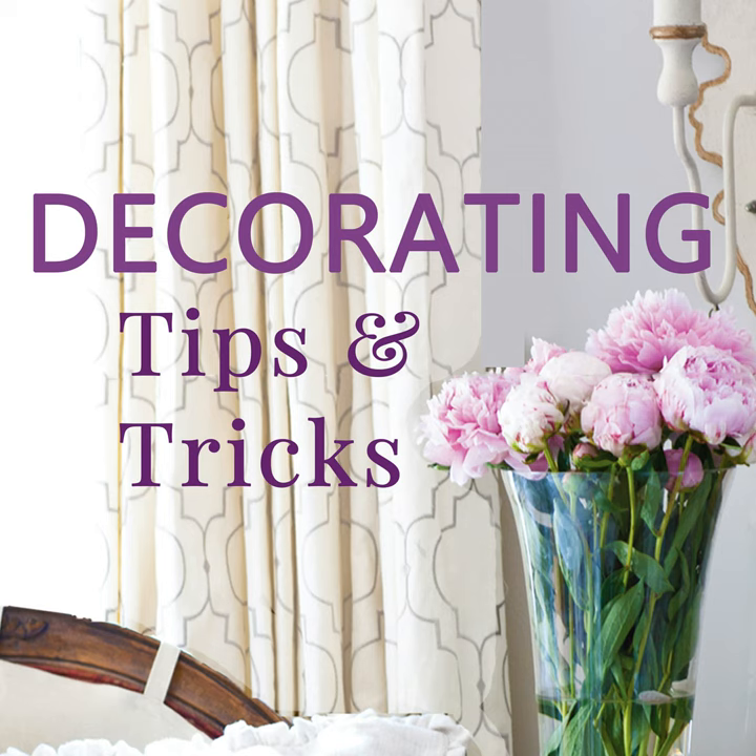A DIY I have done myself — small and easy, done by yourself — is to take those strings off the attic stairs. You know the attic stairs in your ceiling with the long string? It's not very sightly to see that string hanging down. So I took them all off and put in a big eye hook. Then you get a piece of wood at the hardware store kind of like a broom handle — about five or six feet long — screw a hook on one end, and use that to pull down the stair ladder and push it back up. Then you store that hook thing in your closet when you don't need it.